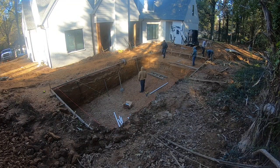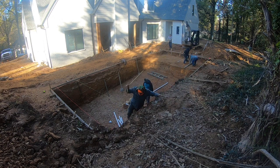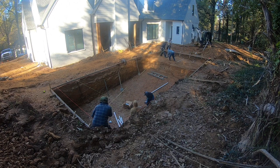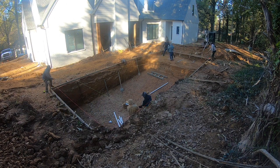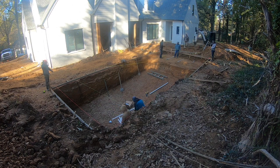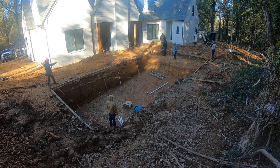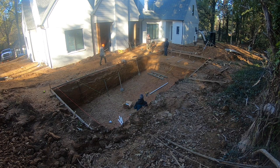Now I've basically finished the rough digging. We've pretty much put the edge forms up all the way around the pool and got the pool dug. I've got my guys here to help with rebar and plumbing — we're at that stage. The dirt is basically all gone. These guys are checking square because now's the time to get the edges of the top of the pool square with the house. I was out by about an inch — that's pretty good. Now here comes the plumbing start: putting in pipe, the two main drains connected through a T that comes out of the pool. At this stage you put in the plumbing for the main drains, the two skimmers, the water leveler, the bubblers, your returns — everything goes into the pool at this stage.